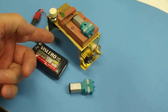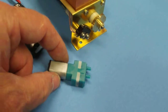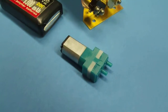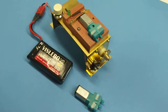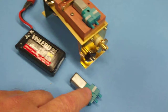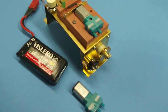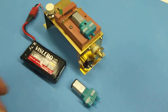This gadget here is used to test these little low-pressure blowers, which in reality are produced for industrial use. A specific application is those little blood pressure cuffs on those little units you can buy and use at home. It's a six-volt motor and a very simple one-direction double diaphragm pump. We use them in model submarines as a low-pressure blower, which gathers air and discharges into a ballast tank.